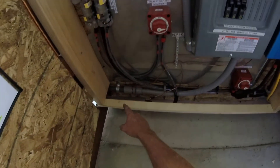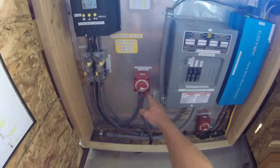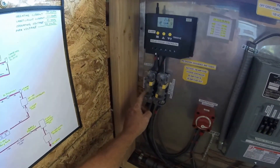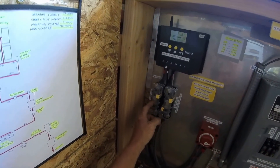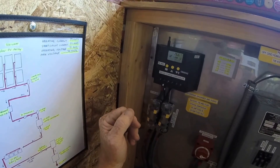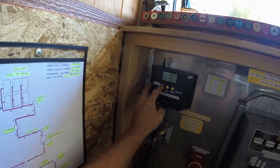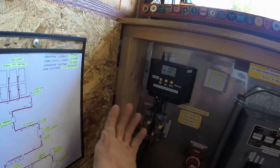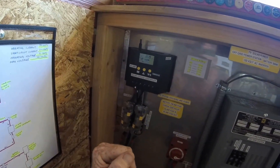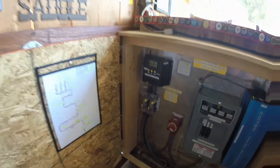Everything comes in the bottom — there's my grounding rod coming in, my PV coming in. Positive comes in, goes up to the disconnect so I can shut it off right here. From there, power comes back out through a 60-amp fuse — should really have about a 30-amp fuse, but I have a 60 going into my charge controller. I have a regular PWM charger; I don't have the MPPT yet, I've ordered it, but this one seems to be doing pretty good. Right now I'm at 26.6 volts, the refrigerator's on, and I'm bringing in 20.7 amps, which is good — it's only a 21-amp system. Right now in the mid-afternoon, about 2 o'clock, it starts generating at about 10 or 11 in the morning. So far I've been generating about 150 amp-hours a day off my system — it's mid-April so I'm getting plenty of sunlight.